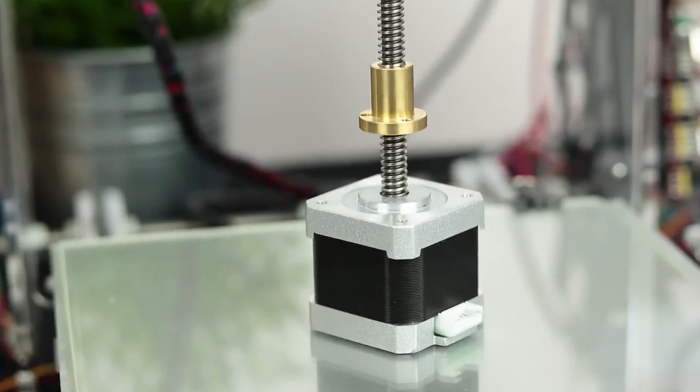From the control board we go over to the stepper motors. In my project there will be three different types of stepper motors and a total of five stepper motors. The Z axis will use NEMA 17s, 39mm long, with integrated 300mm lead screws and lead nuts. These are single-start 2mm pitch lead screws, which give a lot of torque and very fine precision for the Z axis.